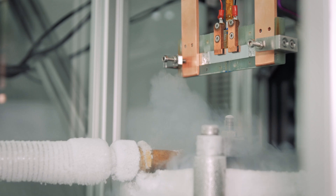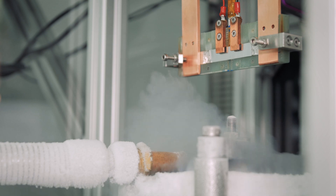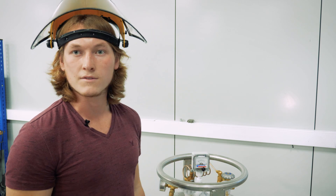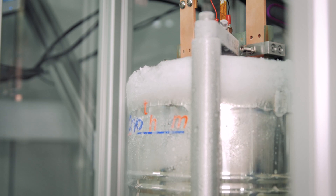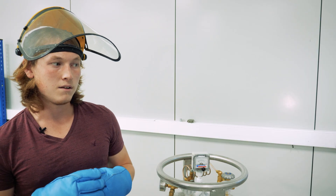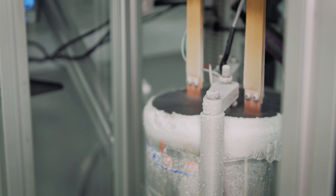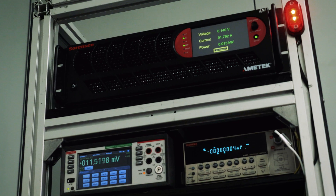What we're doing first is filling it with liquid nitrogen — we fill this can with liquid nitrogen which will then get raised up by one of the jacks to submerge the HTS sample that we want to measure. We'll give it a bit of time to thermalize and then the tape will be at 77 kelvin for the first measurement. The materials aren't superconductors until you cool them down; at a certain point they transition from being a normal metal into the superconducting state, where they are limited by the magnetic field and the amount of current you push through them. Now the sample is submerged and I'm just giving it a couple of minutes to thermalize before setting up the software to start the sweep.